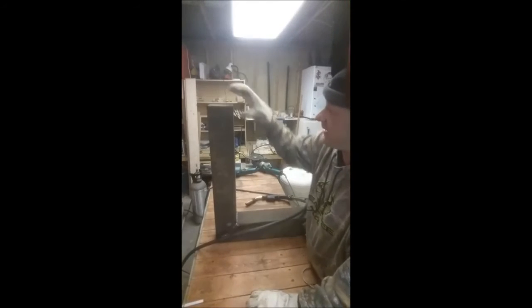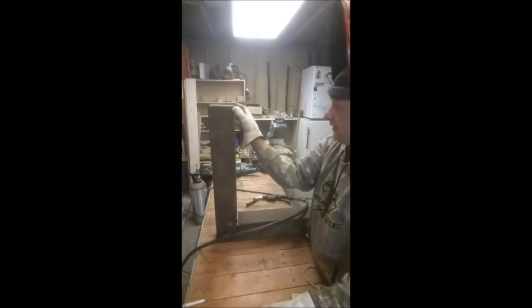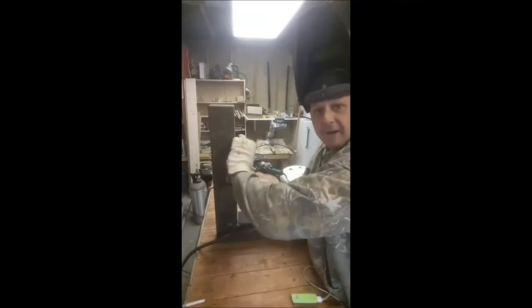But I also want to take something, and we need to have a feed tube. So the rocket goes up, so this goes up the rocket, this comes out the side of the tank, and then we need a feeder so that we can take our wood, our sticks, and stand it up. So that essentially it will auto feed. That's what we're going for here. So we want as much heat as we can get for the least amount of wood we got to burn. So let's get switched over here.